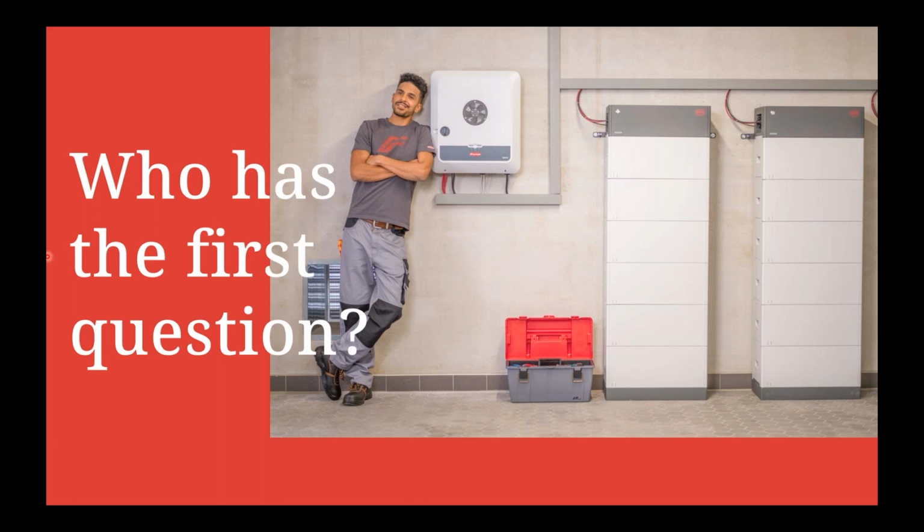What about the SYMO Advanced series as a slave inverter? So yeah, they can also be used. That's a SnapINverter essentially. So they can also be used as slave inverters as well. Okay. Is there going to be a possibility in the future with multiple Gen 24 Pluses and multiple batteries? So I assume you mean batteries on each of those inverters while you're doing the multi-inverter export control. Great question. I hope so. I'll have to check in with the team and come back to you on that.